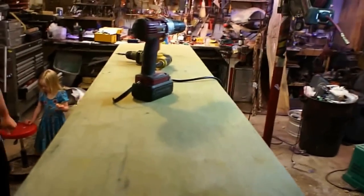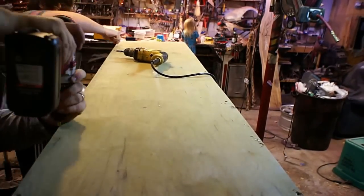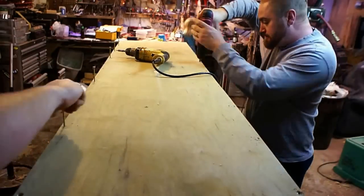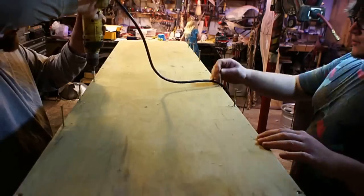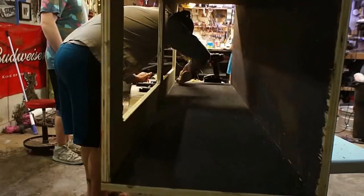After that had a chance to dry, I flipped it over. Now I'm doing the bottom — you can tell because it's the maple — and we're going to do the same thing: go through and pre-drill everything. I'm also going to countersink for these ones; it seemed like the maple was splitting a little more when I was driving the screw down. Not sure if the veneer was a little bit thinner on it or what was going on.